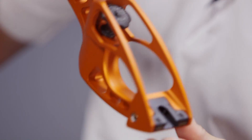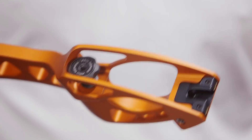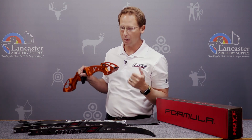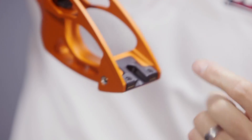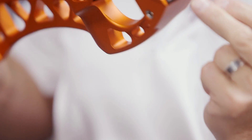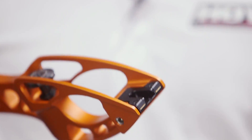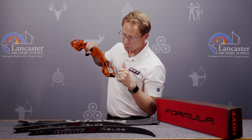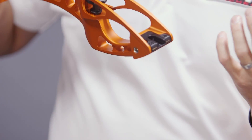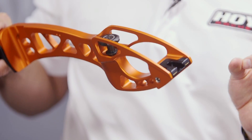We also have an all-new dovetail block. For years we've had the shim system, and we wanted to come out with a better, more stable system. What we have here is what we're referring to as our recurve dovetail block, which has two opposing set screws that actually go into a counter-bore inside this block to give you 100% security that the block is locked down and will not move. We also have a small set screw in the dovetail, which locks down another feature of that dovetail block to give you a little more added security that nothing will vibrate loose during competition.